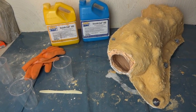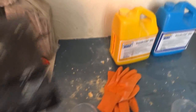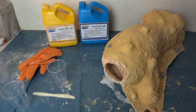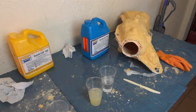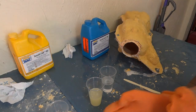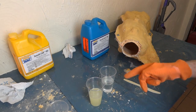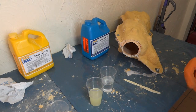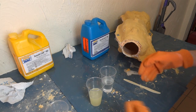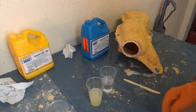I think we need to make this piece about two kilograms, so I'm going to be weighing the mould as I go on a set of scales so that we know how much resin we've put in and when we get to about two kilograms we'll know that's enough. I think it's going to take probably something like eight lots of resin to get up to two kilograms because I can't pour too much in at once or it will spill out of the ends of the mould. We've got to do it in smaller quantities, making sure we keep adding it just before the last coat has cured so it all bonds together in one piece.